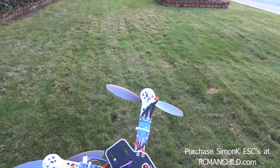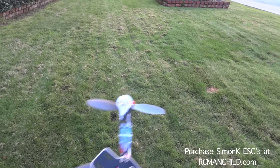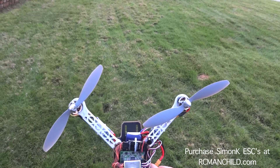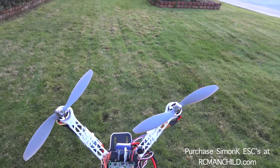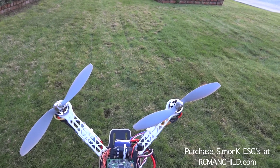These are maybe YGEs — they might actually be Turnigy SSs. A little bit hard to tell with the clear shrink wrap on, but they're just sort of one of the generic Chinese ESCs that a lot of people run on quads. I've got it as dialed in as I can, but there's a wobble I can't get out because the refresh rate of the ESCs is pretty low.